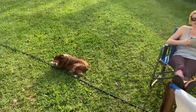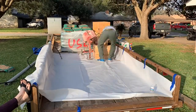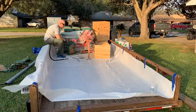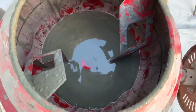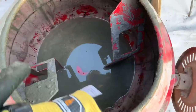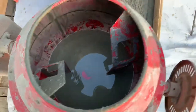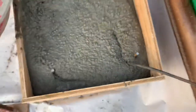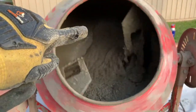I got my supervisor and assistant supervisor. What I've learned with this little mixer is before you put a bag in, fill it up with that little dimple in the middle about flush. Wash off the old concrete and start adding bags — it won't stick to the drum. Before I figured that out I was having to poke it with rebar. What I'm doing over here is working the rebar in to try to get all the bubbles out, get it all mixed in real good.